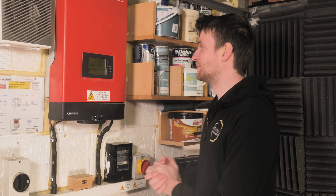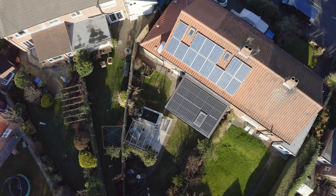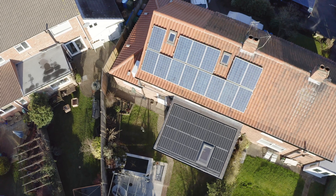We have life — the Sunnyboy has come back on. Not quite as quick as our SolarEdge one, but it's on now. We can see we're generating 1.7 kilowatts from the old system. Both solar systems are now feeding into this home even though the battery has brought it into off-grid mode with no grid connection. This is critical for our G98 and G99 applications — we're not allowed to feed power back down the grid during a power cut for safety reasons. But with the Tesla system, the gateway has completely disconnected the system from the grid so there's no way it can feed power back.